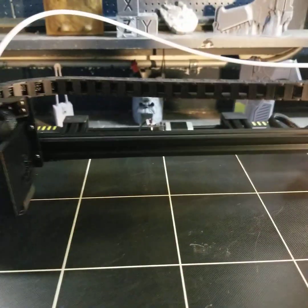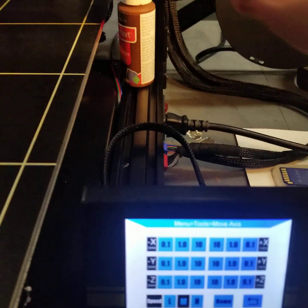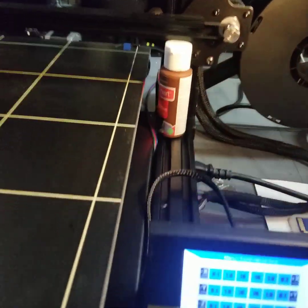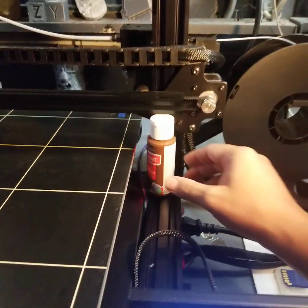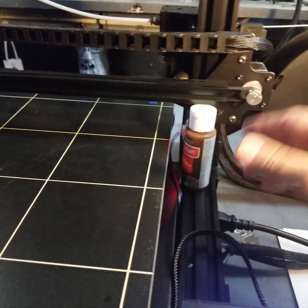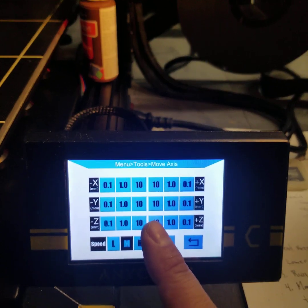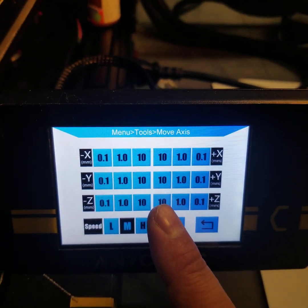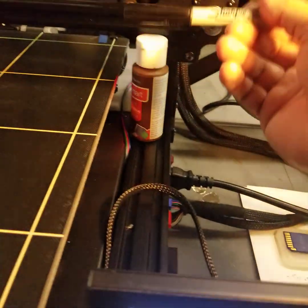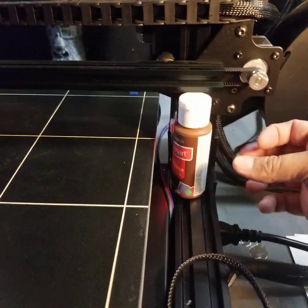Then just make sure before you move your bar, you manually go in and start making it move. Just keep in mind you don't want these bottles under there anymore, especially if you're going to go down closer to your bed or go to Z home - be cautious. You'll use your higher numbers to get close, then start using micro adjustments with 0.1 or 1 millimeter increments, then do the manual clamp adjustment. That's step number one in my bed leveling process.